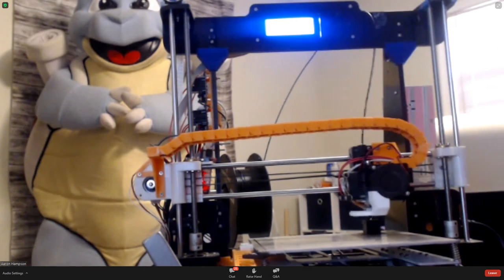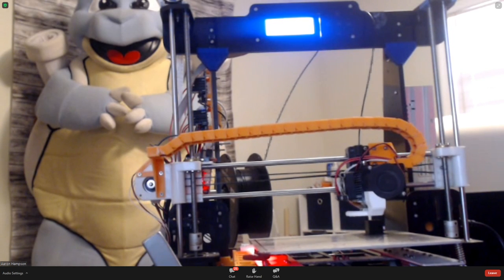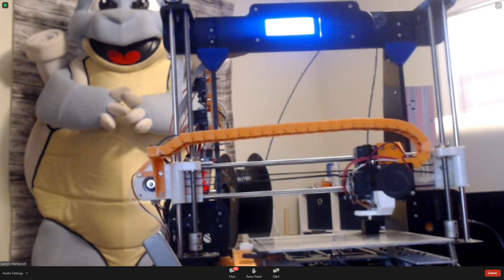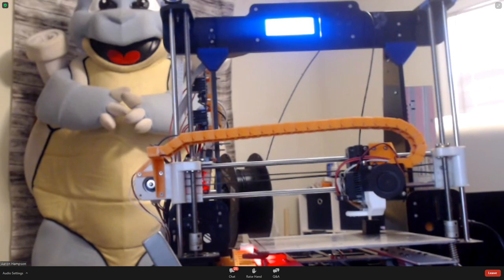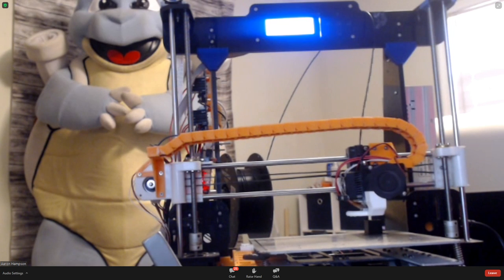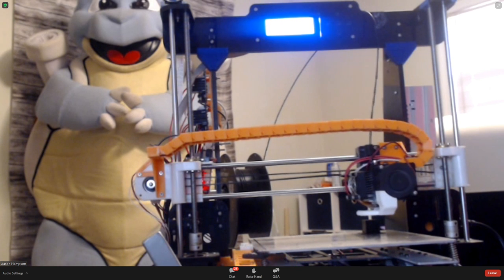It just depends on the material. If you use carbon fiber, it's going to be durable. If you use nylon, it should be pretty durable. ABS is pretty durable, but it's terrible to print with. You have to make sure that the temperature around the printer is perfect and there's no draft, no breezes or air drafts blowing through. But it's pretty durable too.